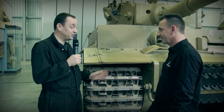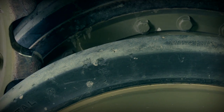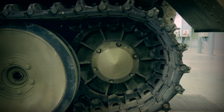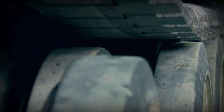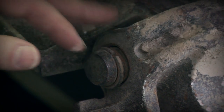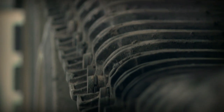On the Tiger, first parade, it's quite a long-winded process so it does drag on, but it's better safe than sorry. The first thing we check on the outside of the Tiger, the exterior, is tracks. Tracks are really important because of track wear and track pins — each pin has a clip on the end so it retains the pin within each link. You've got to watch out for things like that so nothing comes apart.